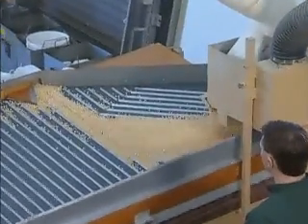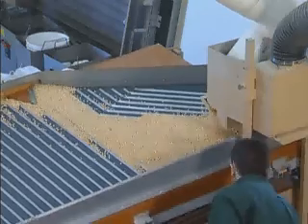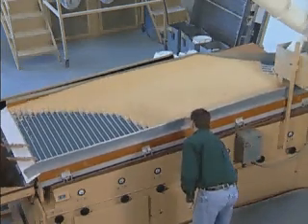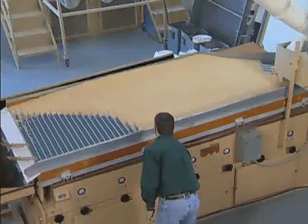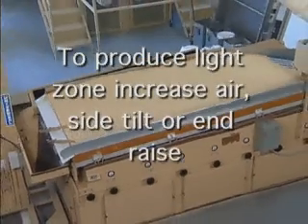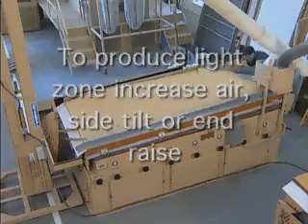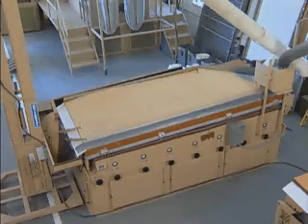Turn on the machine. Open the feed gate slightly, then adjust the eccentric speed so material begins to flow up the deck. Wait until one half of the deck is covered with material. Adjust each air gate to provide just enough air to keep the material in a fluid state. Best results will be obtained by adjusting each air gate in succession, beginning at the feed end. If a light zone fails to appear, slightly increase the air, side tilt, or end raise. After the deck is covered completely, observe for a few minutes how the material is flowing, then readjust the controls to obtain the best possible separation. For additional separation procedures, click on the operational adjustment icon.